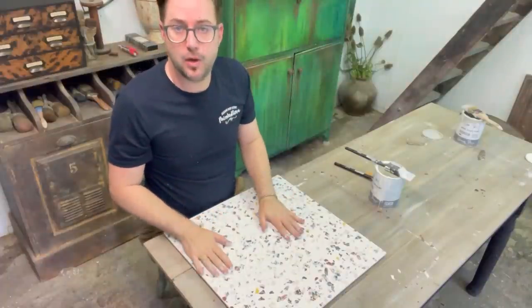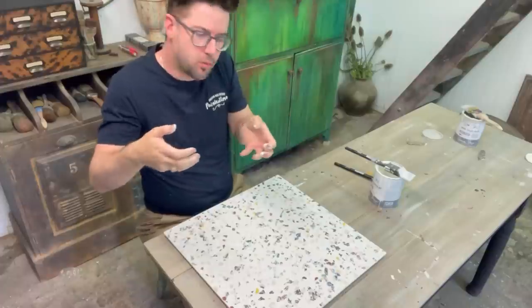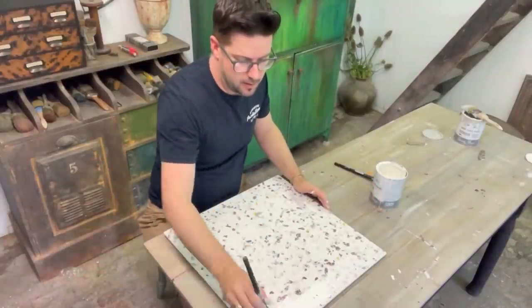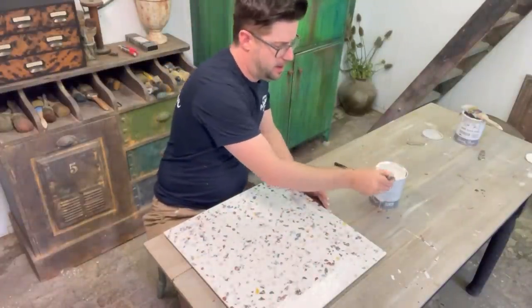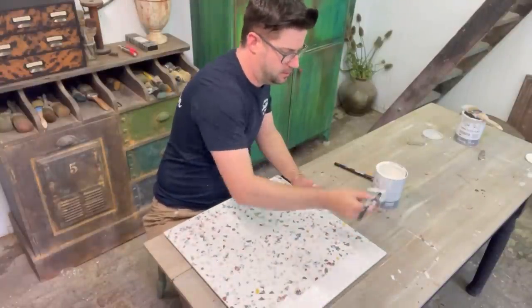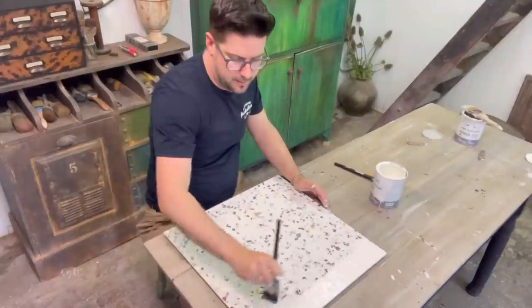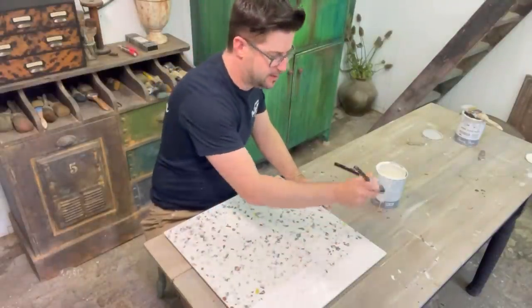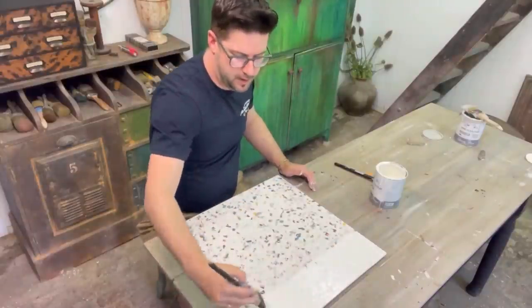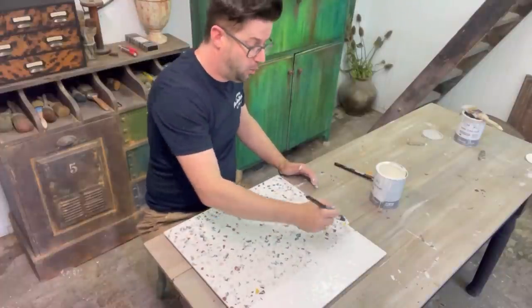So now we're going to go back over with a healthy-ish coat of paint, which should then enclose the gaps around each chippet of paint. So in with the same colour again, we're going to go down with the old white. I think drying time is quite important because you don't want these to lift up or the paint to submerge around. So just go back in over everywhere, liberal amounts. We're going to lose them for a while until this is really, really well dried out.